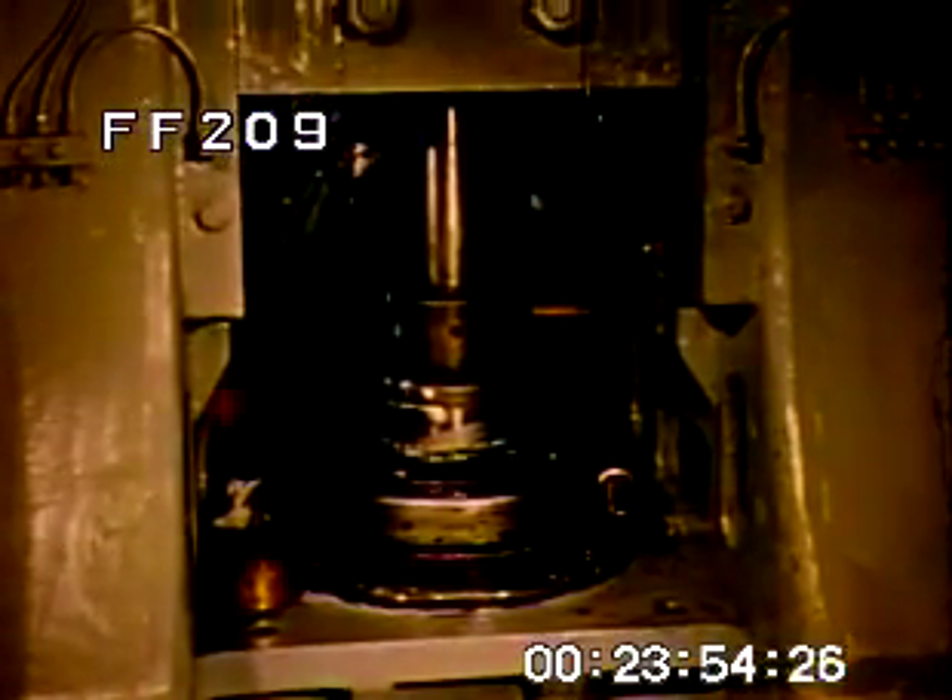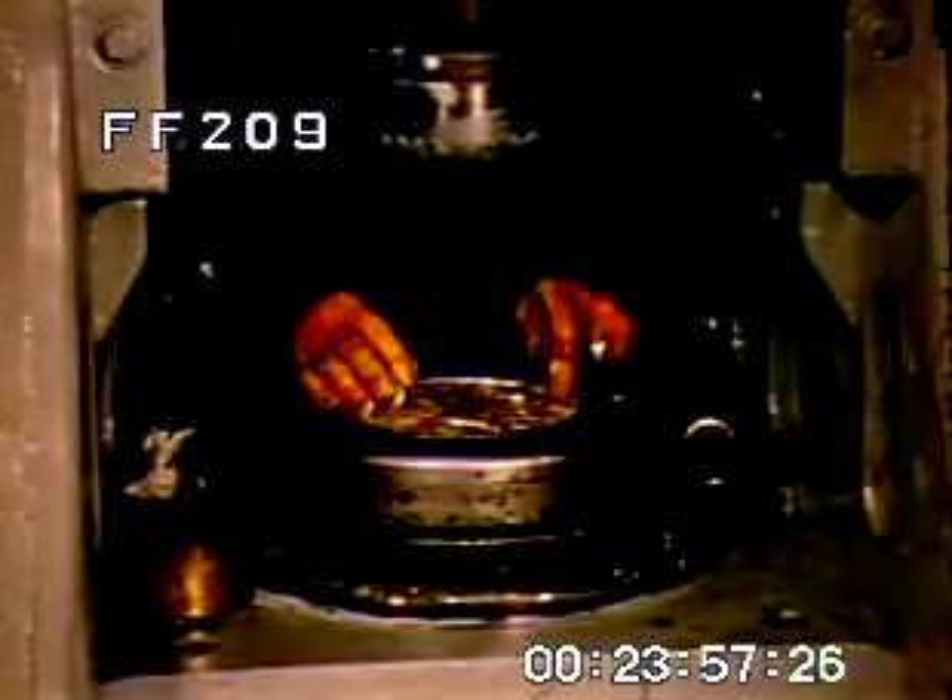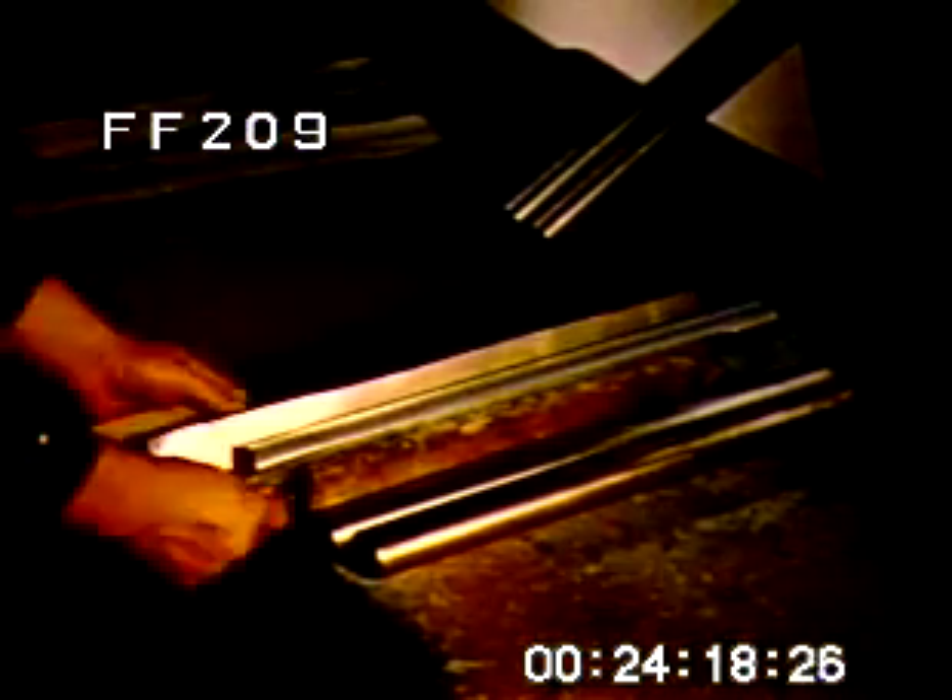A second gold-filled material is wire. It begins as discs cut out of the flat stock. The discs ultimately become shallow cups, which don't even look distantly related to a piece of wire. But after several stages of shaping, the tubes will be ready for conversion to slender and even gossamer-like strands. Since this is to be solid wire, the carat gold stock is slipped over a core of base metal, to which it will be united by the intense heat of the bonding furnace.